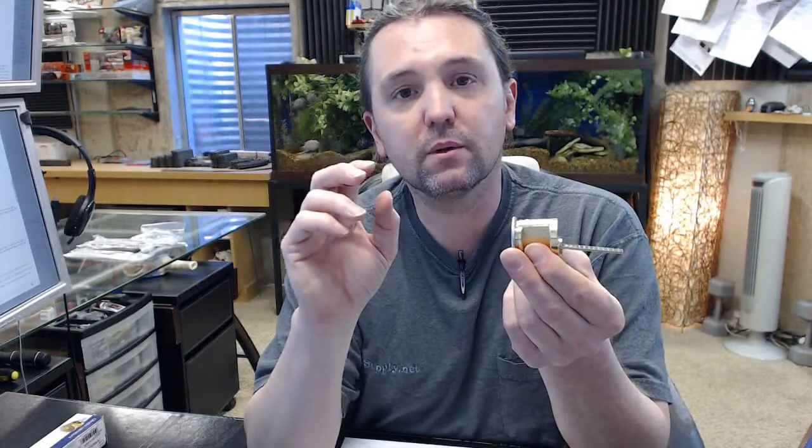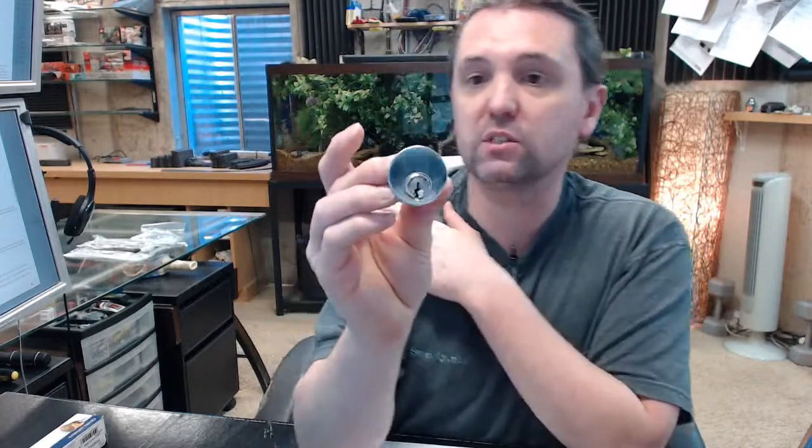It is a rim cylinder. Flat tailpiece in the back, and this type of cylinder, being a rim cylinder, is very generic, ubiquitous, used in a variety of applications. Whether it be a cylinder shut off for an alarm, or exit device trim, or perhaps you have a surface-mounted deadbolt. Rim cylinders are the almost do-everything sort of piece of hardware.